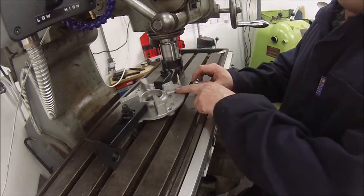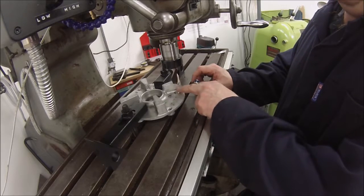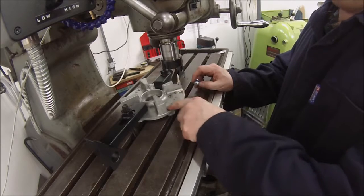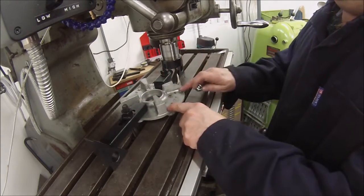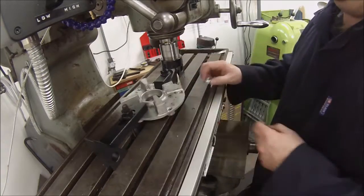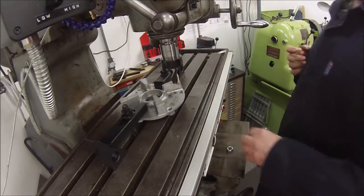So I just have to relieve that away and then nick a little tiny bit out of the cush drive rubbers. There's six bolts altogether for the sprocket carrier. The ones here over there are fine, it's just these ones this side and the opposite side. So I'll just do this manually very quickly, nothing too complicated on this one.